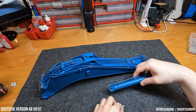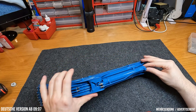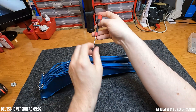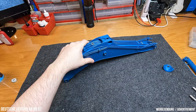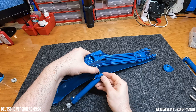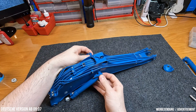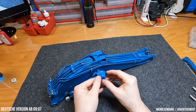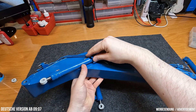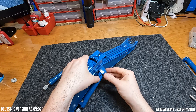Now we come to the hydraulic cylinders. I am not going to finalize the stick cylinder on the upper side yet — here I just check that everything is seated correctly. The later assembly is easier if the cylinder is not yet firmly installed. The two lift cylinders — you can actually see them now — are mounted with the piston rod facing downwards. The two bearing bells are pressed into the holes with their pins. They do not need to be glued, because of the bolt plates on the outside everything holds together wonderfully.